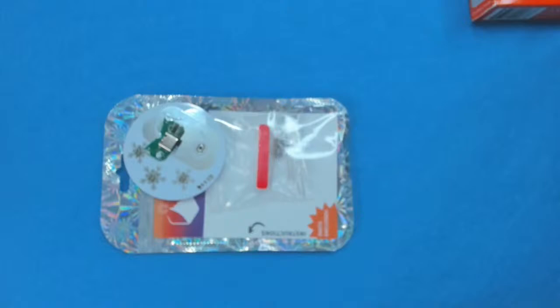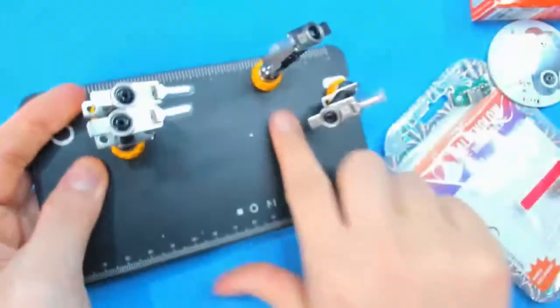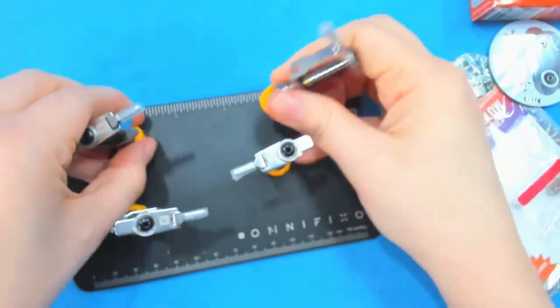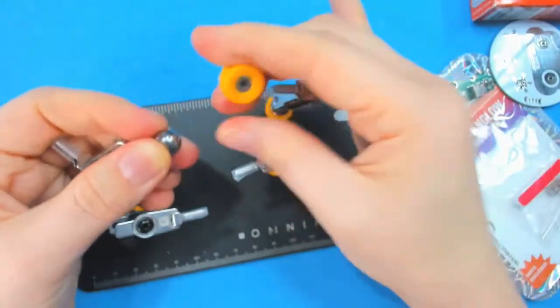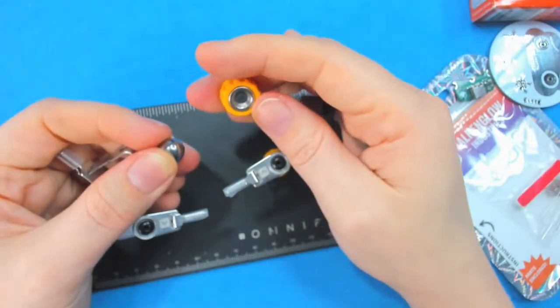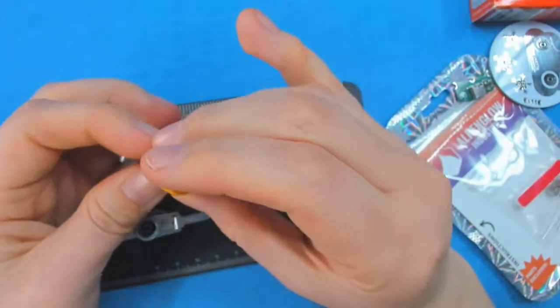It's absolutely true. Anyway, so let's also pull out this other thing that I love, the OmniFixo, which is a wonderful little third-hand device that you can use. Got 4 different silicone covered jaws on magnetic ball mounts. You can slide them around, you can take them off, you can flip these around. Notice that one side is insulated and one side is not. So if you want to actually connect this to the ground plane, you just flip it around. And, ooh, it's trying to make a break for it.